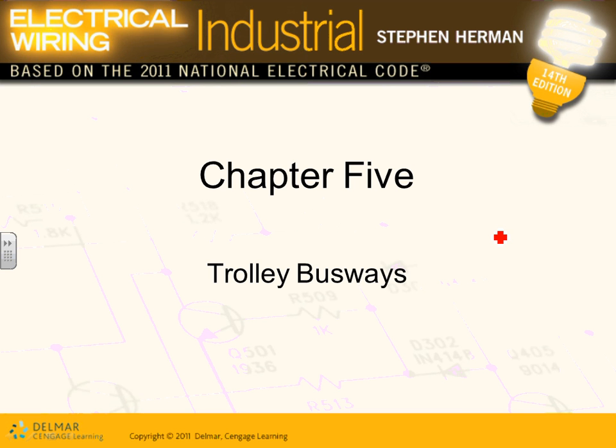Unlike plug-in busways, where in order to feed from the busway you have to plug it in, if you are to move the machine, you have to unplug, move the machine, plug again. That's a plug-in busway. The trolley busway has a track where you actually unplug the machine, like a receptacle. All what you have to do is just unplug that receptacle, move the connection along the track. There's a track to any location that you want along the path of that track, and then plug the machine in again, and you're up and running. So you don't have to mess with plugging the disconnect itself.